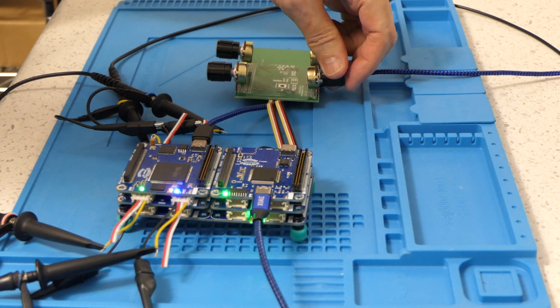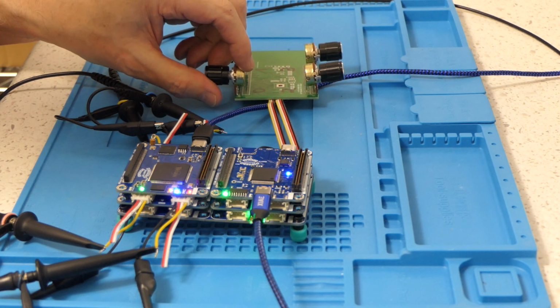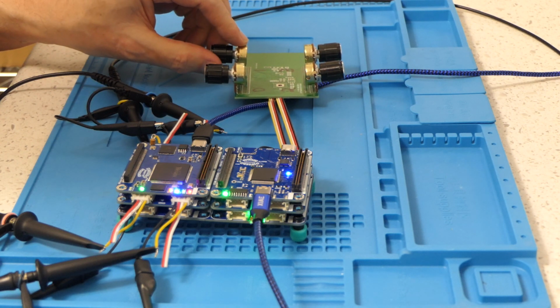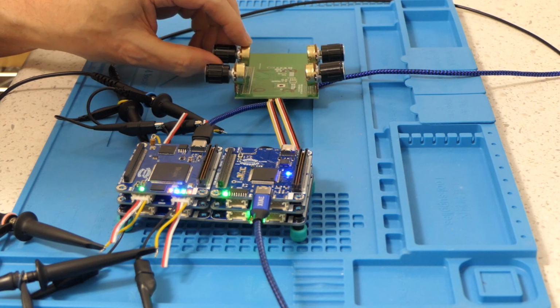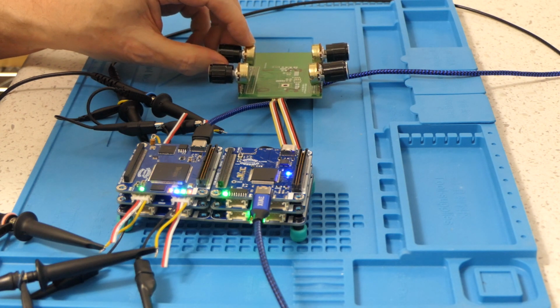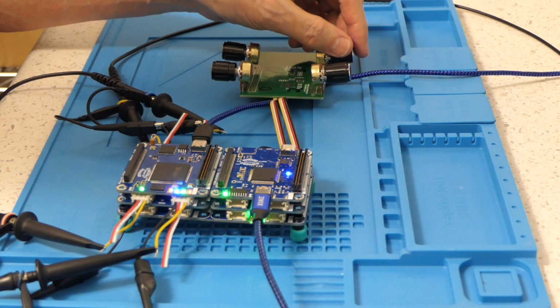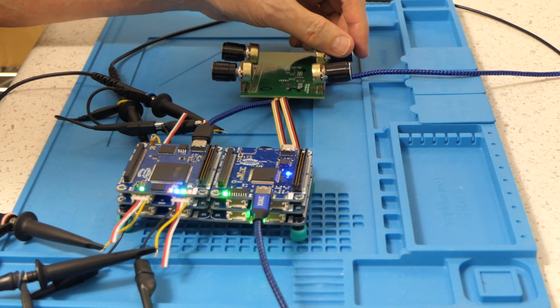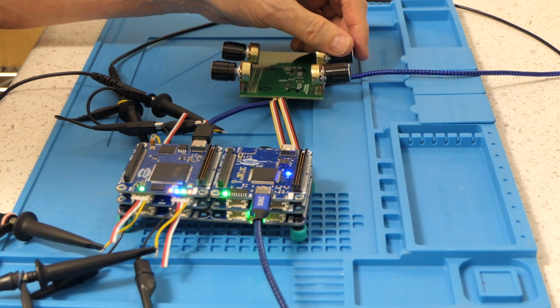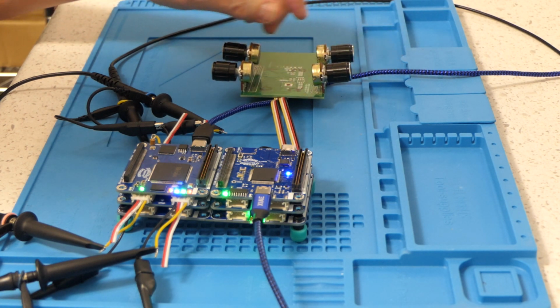But so I really like this Risc-V. This particular one here, the 307, has a maximum clock speed of 144 megahertz. It's not fast, not slow. You know, it's pretty good, pretty nice. I kind of suspect as time progresses, maybe we'll start seeing some of these Risc-V microcontrollers start running into the 200 to 500 megahertz range. A lot like the STM32 line in their H series, like the H745, 747 run up to like 480 meg. It'd be cool to have a Risc-V running at about 400 meg, nice zippy. That'd be cool.